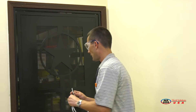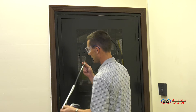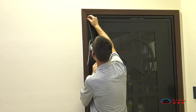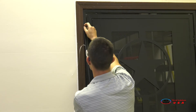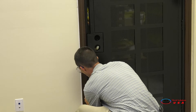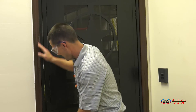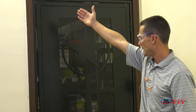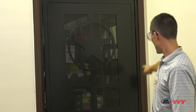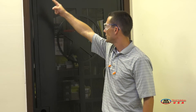Last but not least, I've chosen to use some weather stripping on my door. This is totally optional, but any hardware store you should be able to find weather stripping. All you're going to do is take off the paper backing and stick it right down the border, running it down the edge. I've run it down one side right here. At your home you'd go ahead and finish it out and go down both sides, but for today's video I showed you how to run the one strip.